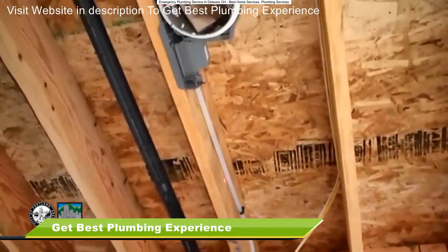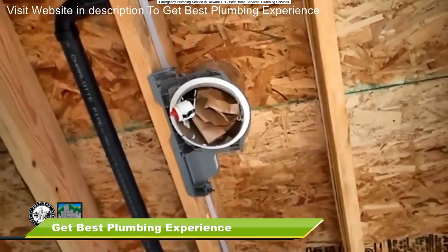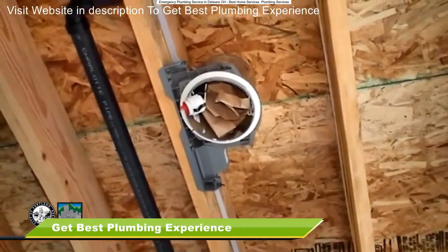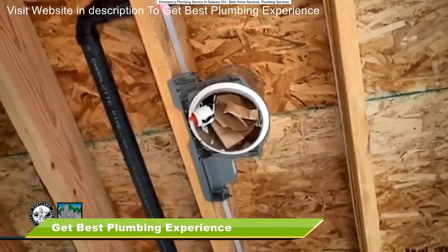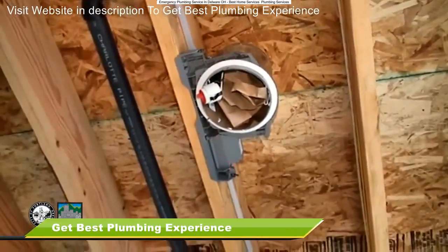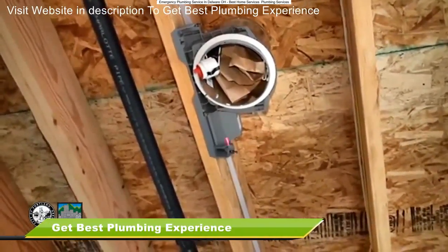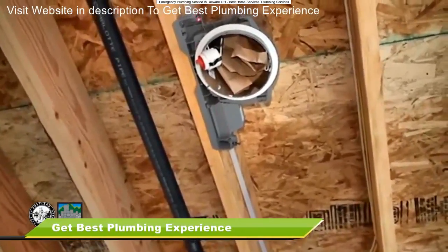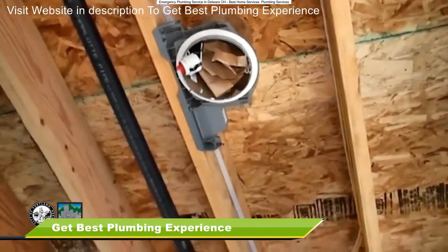As we come up the water system, pay careful attention to this little piece right here. On the cold PEX side, it's too close to this light right here. It has to be 12 inches away or it could be subject to melting. These can lights get very warm, and we don't want that to melt right there. So we're going to have the plumber fix that. Other than that, everything's okay here.